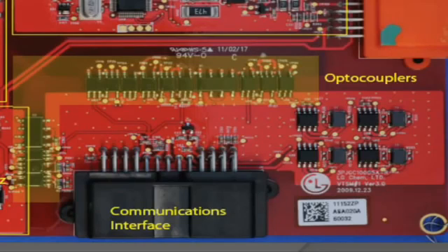Over here is the communications interface, and everything is nicely isolated electrically by optocouplers, because you have this huge voltage range falling across the cell stack. In this particular case, you have four identical pieces of electronics collecting that information, and they break it up into virtual ground islands to make sure the electronics can accommodate that shifting voltage level along the stack.